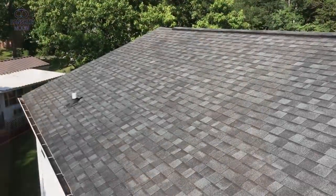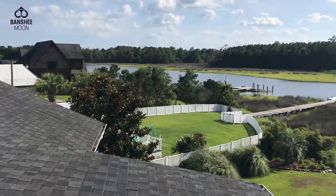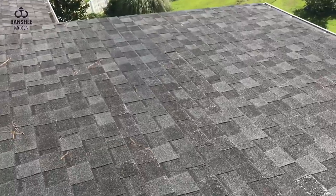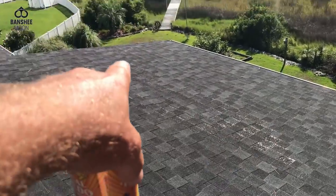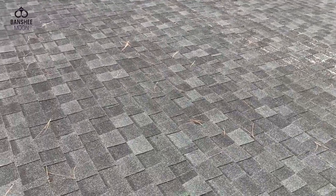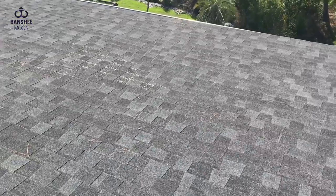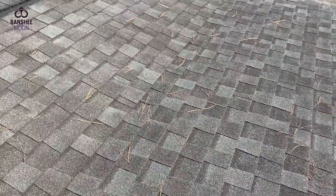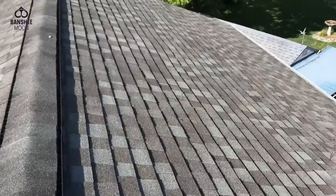At first it looked like little animals were getting in here and curling up, but I think maybe the AC contractors who installed the AC pushed this stuff — what little there was — out of the way when they put the duct lines in. This is the side I wanted to put the vents on, but this is the side that takes the prevailing winds. You might have seen a video I did where I replaced these shingles — some shingle damage from a little tornadic action. You can see damage right here; whatever took those shingles up stripped the grit off. There's no trees around, nothing hit this, but just that little five-foot area is all stripped down like old shingles, and these shingles are about seven years old. So anyway, I'm going to put the vents on this side.